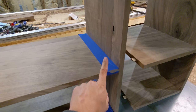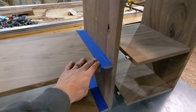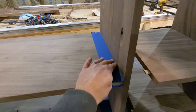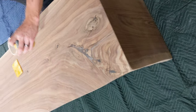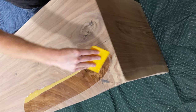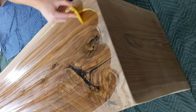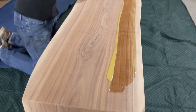Something I wish I would have started doing sooner: I'm putting blue tape down. I already sanded all of this to 120 grit and I don't want glue getting on it and ruining it — trying to sand in tight corners never works out well. I'll put blue tape on the edges, wipe the glue after clamping, and peel the tape off right away. Then fast-forwarding through sanding — I start with 80, go to 100, then 120, finish with 150 — before adding Rubio Monocoat pure finish. I think Rubio pure on walnut is the best combination; let it sit 15 to 20 minutes and buff it off with a dry rag.